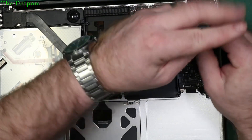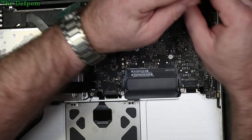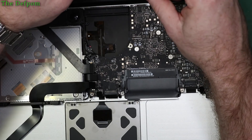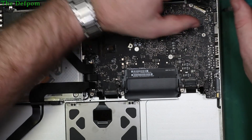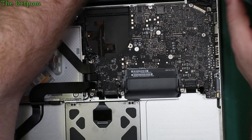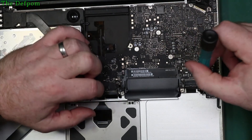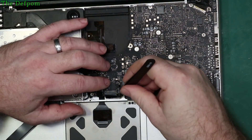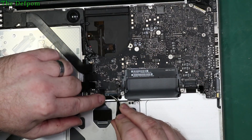These don't like to be stressed — these connectors are very fragile and they do fail. You can actually lose a RAM slot. If you lose both then you might as well throw the thing away because it's really hard to fix — almost impossible. And there you can maybe see the corrosion on that connector there.